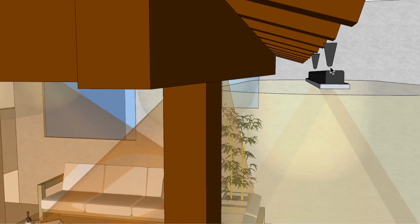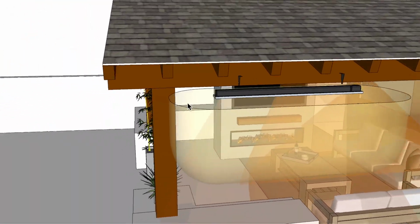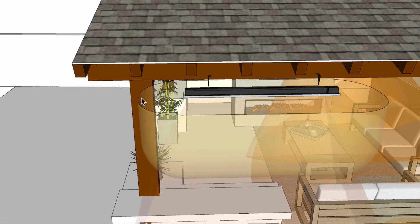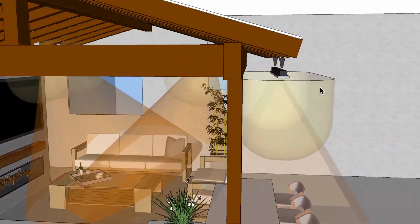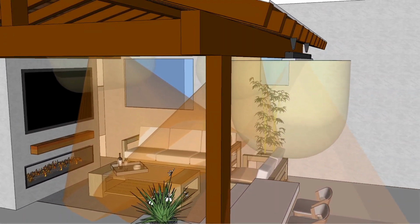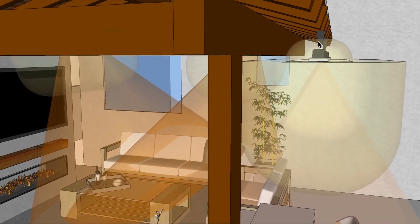So with this drop here, we're meeting the clearances here, and I do have this pushed over so that we are meeting the clearances on the left hand side here as well. So this is 18 inches from this edge to this point, and of course 18 on this side and all four sides there, 36 inches down, and so we're not penetrating this support beam as well. Looking at the top clearance, no problem with that, 6 inches with the OEM bracket.